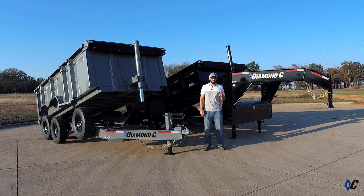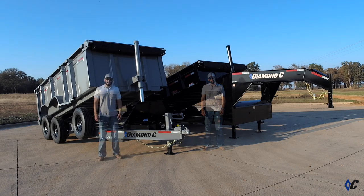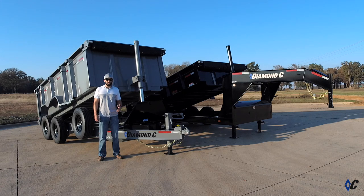What we've got here is a telescopic cylinder package. When you get down to the core of it, these cylinders are much like what's been used for decades on semi end dump trailers and heavy duty dump trucks. It's a three stage cylinder that uses a KTI brand power up gravity down system to help conserve energy.